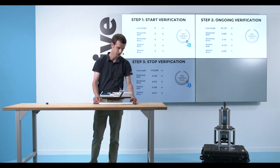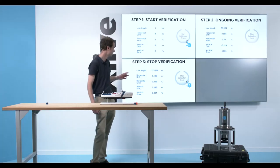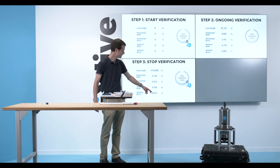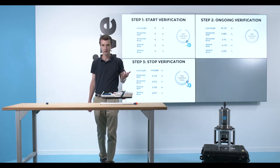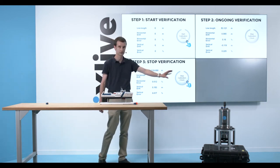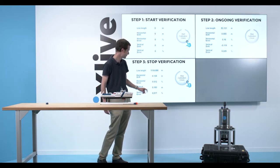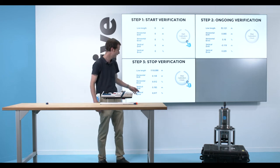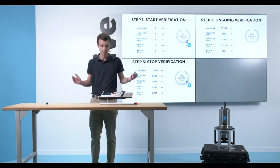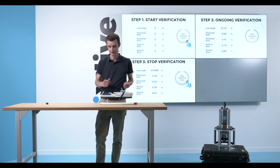And when I reach the end of this calibration line, about the same length as the original calibration line, a little bit more than 1,000 meters, those values will stabilize and give me a very accurate result. So for example, here it's a real set of data on this Rovins Nano DVL kit, and I have an error of about 0.01% of the travel distance horizontally and 0.017% of the travel distance vertically. I know I did a good calibration, so I can continue at sea, and now my INS DVL kit is ready.